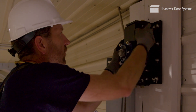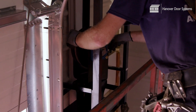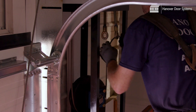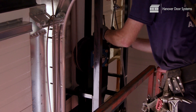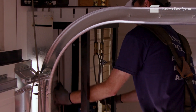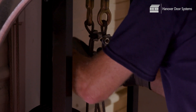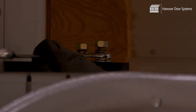Position the cables over their respective pulleys at the top of the tracks. Using cable clamps, fasten the cables snugly to the eye bolts at the top of the tower. The short cable stays closest to the wall with 10-inch pulleys, and the long cable stays closest to the wall if 6-inch diameter pulleys are supplied. The top of the top empty weight box should be at the correct height — this is important for proper weight adjustment in each weight box. Use two cable clamps on each cable at the eye bolt for larger doors. Tighten the 3/4 inch nuts on the weight-side cable eye bolts until there is enough thread for both nuts and lock washer on the eye bolt. Repeat on the long cable furthest from the wall, but leave half an inch of thread showing after both nuts and lock washer have been threaded on.